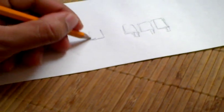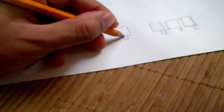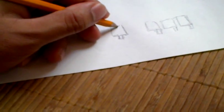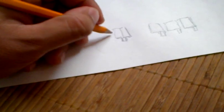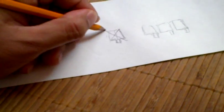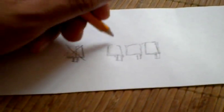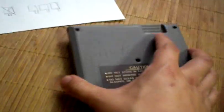Now if you find one where the dog tooth is exactly in the middle — consistently centered — then that would not be a converter. So those are not the ones you're looking for. Basically you want to look for a five-screw setup with the offset pins. I do have a five-screw setup here, but this one does not have the offset tooth.